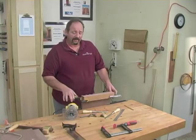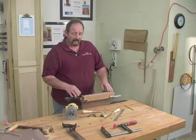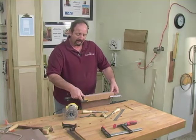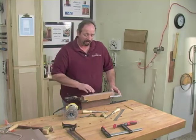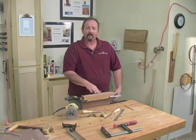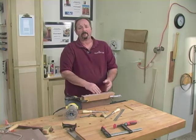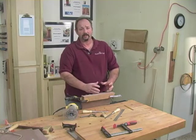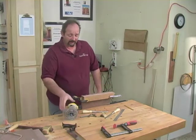You can see what I have here — I've got this rigged up and set up to use a router to remove the waste. I've got a secondary piece, a sacrificial piece, that's attached to my board with a couple of clamps where the edge of my board and the edge of the sacrificial piece are flush. That's actually going to help carry the router so I'm not trying to balance on a three-quarter inch end, and that's a vital part of what you're doing here because it makes the work so much easier.